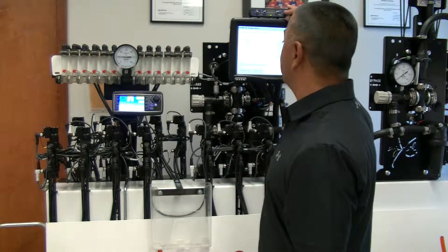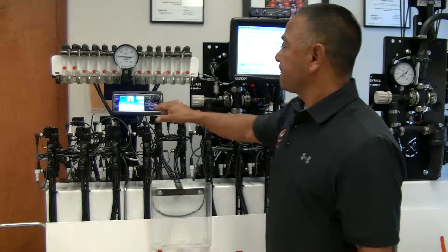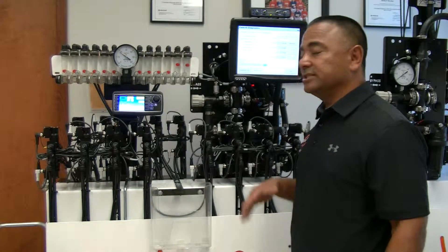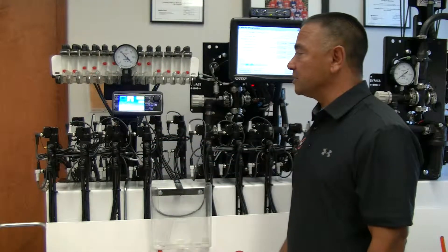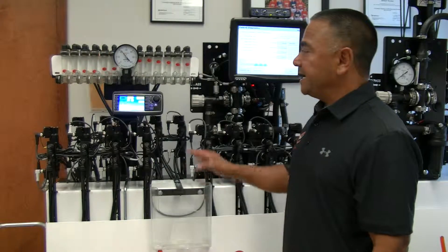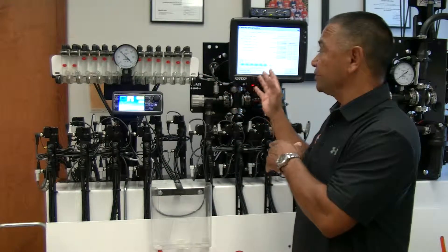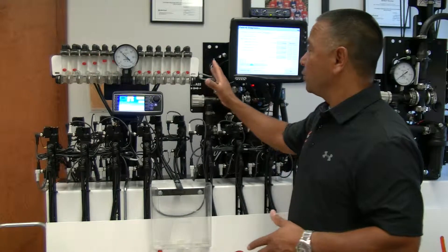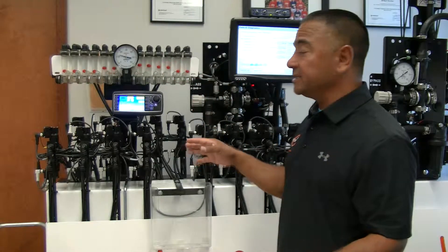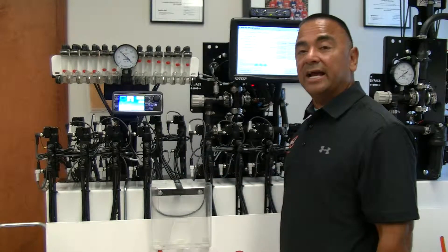It also allows you to see where each one is being managed. If I turn my sections back on, it'll show you which sections are on and which are off as it goes through the field performing swath control. This controller works independently of the OEM controller — whether it's Trimble, AG Leader, or John Deere, it doesn't matter. We're not connected to the rate controller; we're managing pressure and flow efficiently all independently. That's the AggCell GX30i VRT.